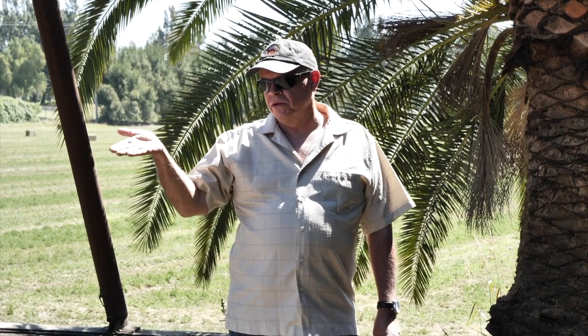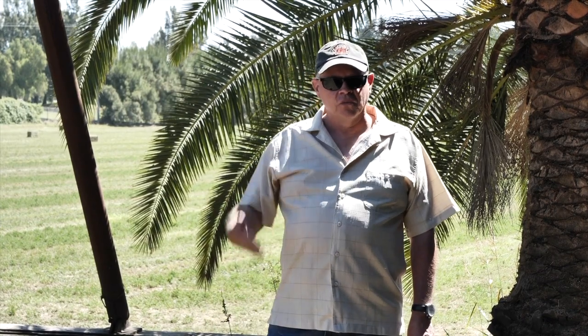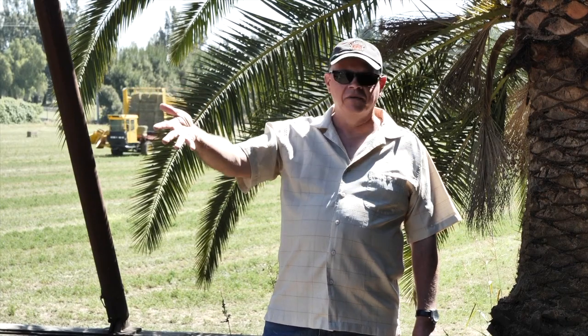And when Russell talked about this 0.2 feet per second, I want to put that in perspective. If you were out strolling around in a park, you're probably walking at 2 feet per second. So we're talking about the flow coming through the screen at about 1/10 of the speed we've been strolling around here. So it's really coming in quite slow, and that's why he said like a garbage bag may not even stick to it. Yeah. Sweeping velocity and taking past.